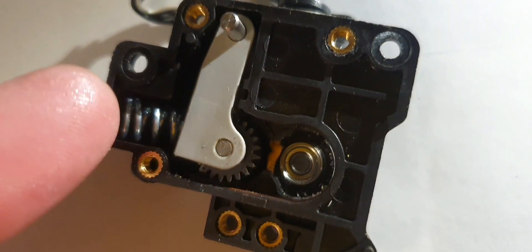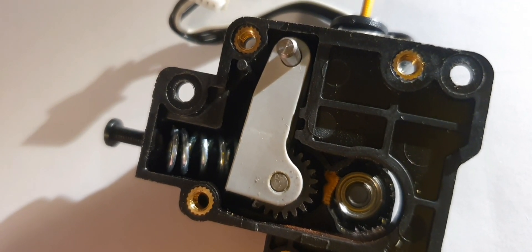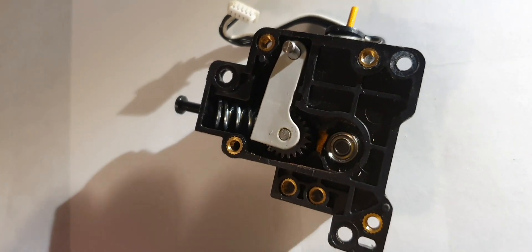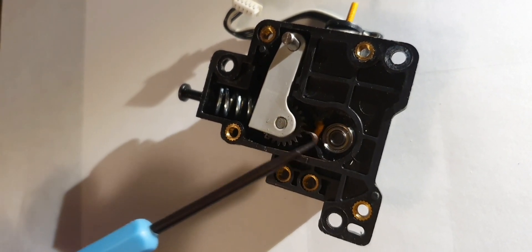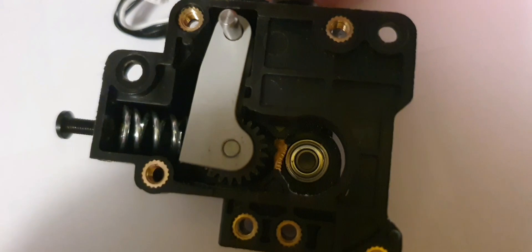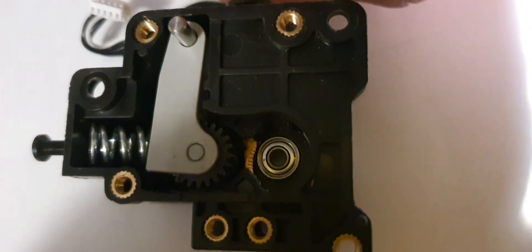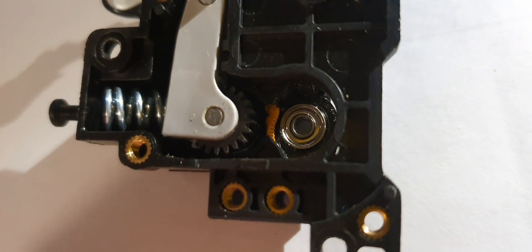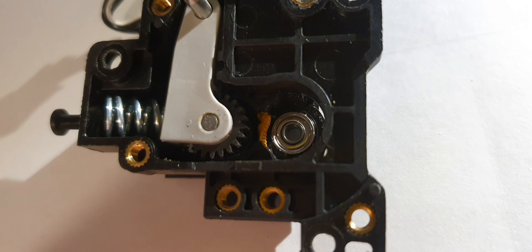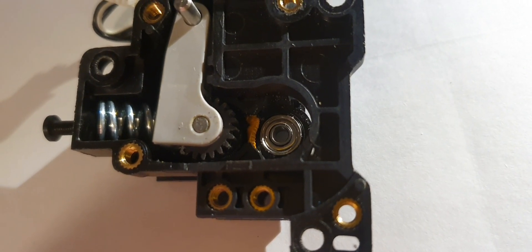In addition to that spring right there, it will push against the filament. This cogwheel here will not move sideways — the other one moves sideways and the actual motion is being pushed inwards. If you look at the way the filament has been pushed, it looks like something that has been repeatedly pushed from the left towards the right, because it basically could not fit through the hole at the bottom. So I don't know if anyone at Bambu can potentially fix this or make a better way of funneling down the filament.